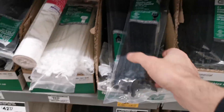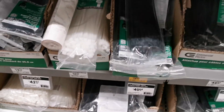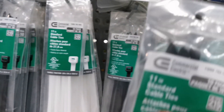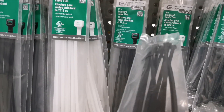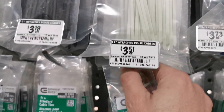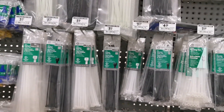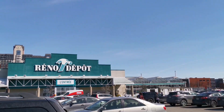For zip ties — also called cable ties — we need these to secure the gutters to the frame. Use eleven-inch black cable ties. Black is super important: white ones will be degraded by the sun, the polymers will break down, and your zip ties will break. Get black UV-resistant ones. They come in packs of ten — get two packs; that runs about three dollars fifty-one a pack in Canada. You'll use twelve and keep eight as spares for repairs.